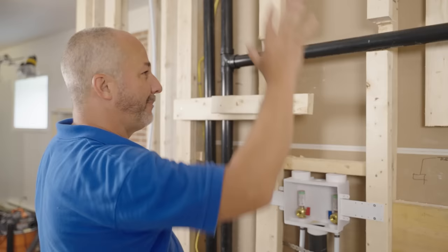There we go. It's even more important than the one that carries the weight, because when you're working with drywall, if you put up a sheet like that and then someone opens up a door to a room, the difference in air pressure will pull it right off the wall, land on your head. That's no fun. That's experience talking. Next, we got our drywall and let's get hanging.